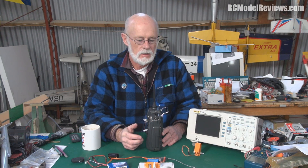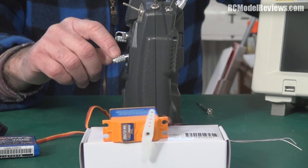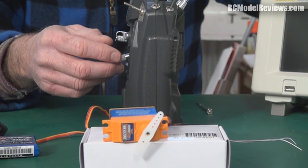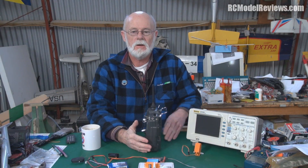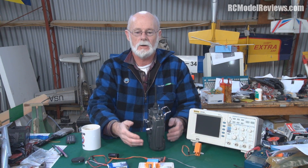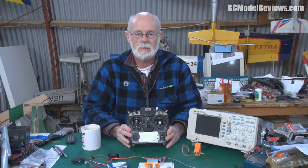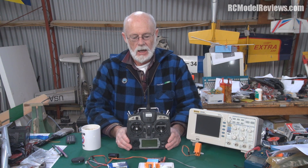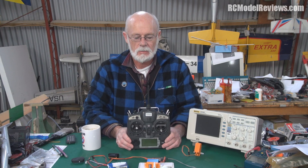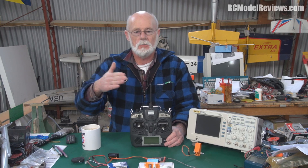And now we'll take a look at the Coreless digital servo, see if that's any quicker. So as you can see, the servos do make a difference. It's a small difference, but it's an important one and it is quite a bit more than the actual radio itself. So if you're looking for a low latency system, you've got to have a radio with low latency — somewhere between seven and eleven milliseconds — and you've got to have fast servos, which generally means Coreless digital servos. They have to be strong enough to accelerate the control surface and stop it quickly enough.